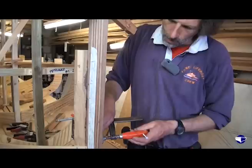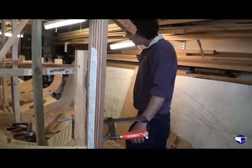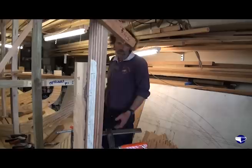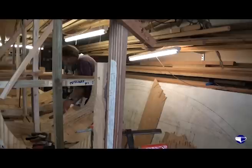Clamp our plank in. Obviously at this stage the ends of our half-laps and where we've planed them away are quite vulnerable to damage, so we've just got to be a bit careful. The main thing is to get the plank curved and more or less in place, and then go back round and nudge it and tweak it into the right position — tap it forward, tap the front down, trim the front and all that sort of business. Working away steadily without trying to force it anywhere it doesn't want to go.